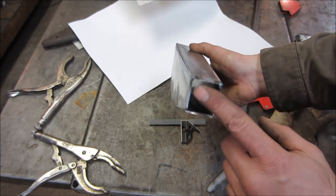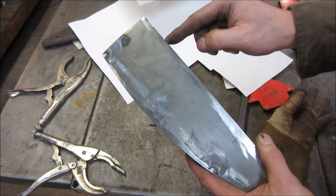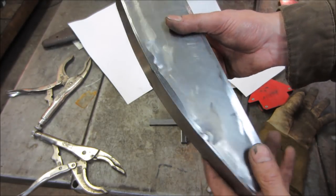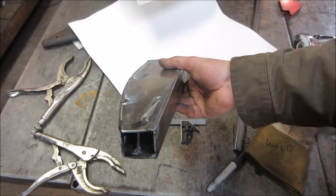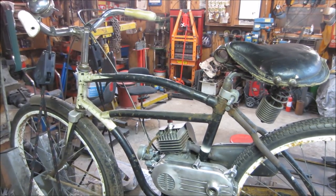And the last thing we'll put in is the back, but we need to put the gas line out and then the gas cap set up in it, and you can't weld it up solid without having a vent hole, so that will be our vent hole until the rest of it's built, and the last piece is, we'll put that on. We'll do one last fit up before we commit.